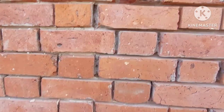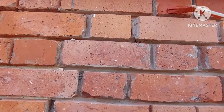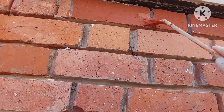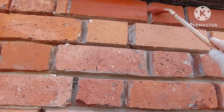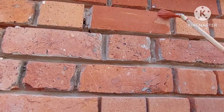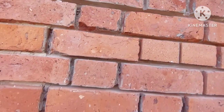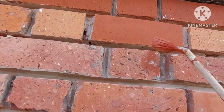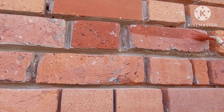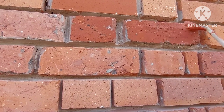It's quite simple. All we do is a little brush and on it goes. When that dries in, these bricks will match the rest of the building. And it's called brick tinting. Now, a lot of these bricks have got cement smeared on. So the plan is to coat it up with the tint. It gets rid of all those little blobs of cement, just disguises them, and makes the building look a lot more appealing.